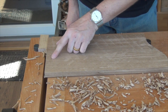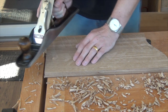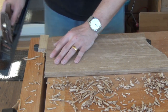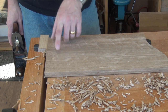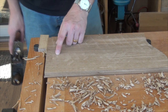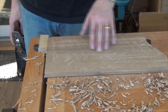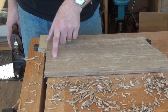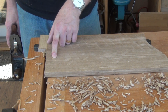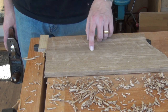Now I've got a little bit of tear-up here because I've come from this direction and haven't changed back to going at an angle. So I know I've gone right the way across the board, so we're virtually flat here. But I have to be careful not to plane any further than where the grain direction changes in the board. I can't be exactly certain where it is, but it certainly has happened by then. So if we go for the lowest point, which is roughly here, try not to plane any further than there.